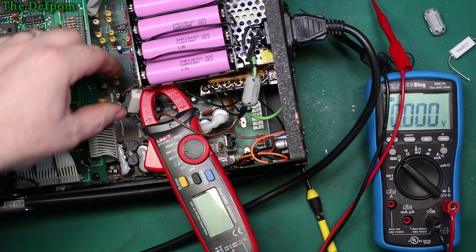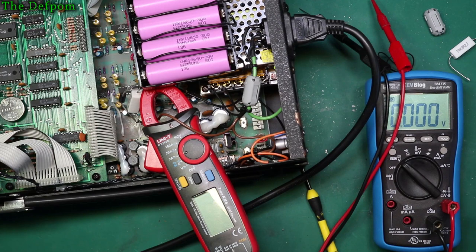Okay, so I'm going to tie this up, mount these in here somehow so it's nice and tidy, and make sure it's not going to get damaged and that sort of stuff. I don't want to have it hanging off the circuit board, this is no good. So I'll do something with that in a minute and tidy that up, maybe run a little wire down, or put it in the middle of that wire or something like that. Probably won't actually splice it in the middle of that wire, that way it's stress relief and that sort of stuff. And that will do the job, that will work fine. Yeah, I'm happy with that. So that's what I'm going to do. That little change there limits the current on those batteries so I can charge them from flat, still work to a decent voltage and that sort of stuff too. So I'm happy with that, nearly done.